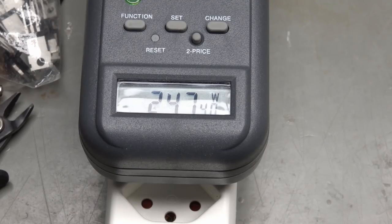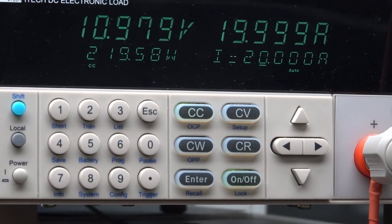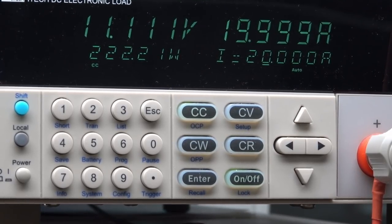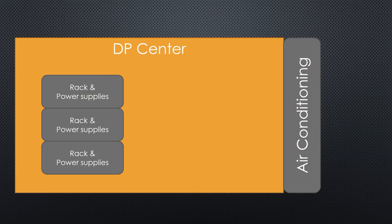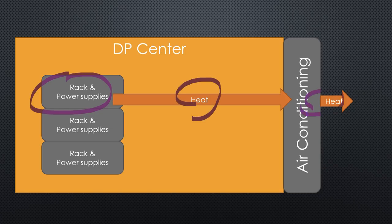They are also very efficient — this one, for example, 90%: 240W input at 220W output. Do you know why? Because the lost 20W are converted into heat. And because temperature must be constant in data centers, the air conditioning system has to remove this heat. So the operator has to pay about 3 times for the lost energy. This is why the fan usually does not run if you do not maltreat it too much — I assume they also chose a high-quality fan.